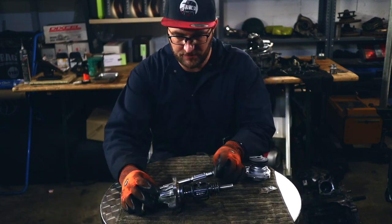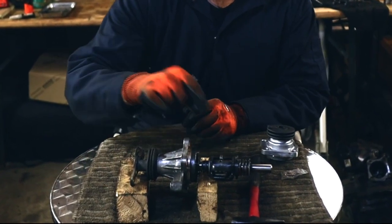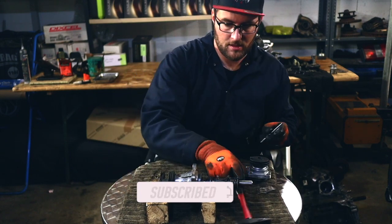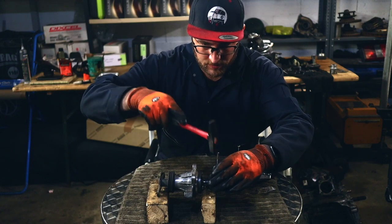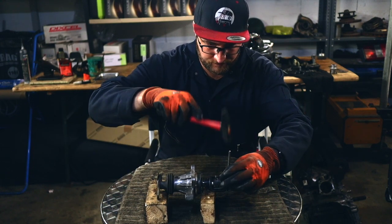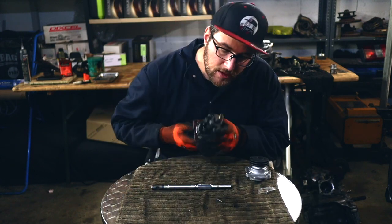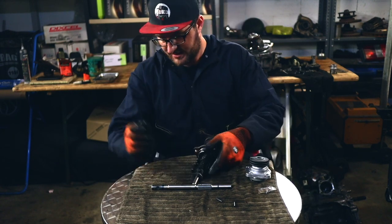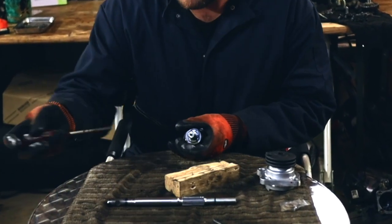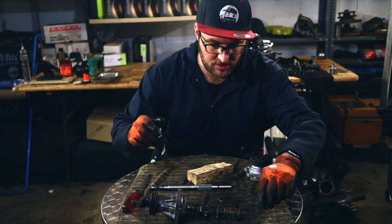It's important to maintain the same order of the parts. I've been punching out these two axles here on a harder surface just to make things go faster — you'll see these axles will pop out like this. Okay, that one is out. Always remember, keep the same order. Now we have to remove this grommet here — just turn, put a screwdriver in and pull it out. Watch out not to mix everything up — keep the order.